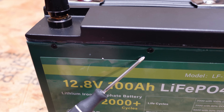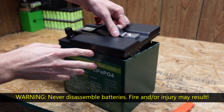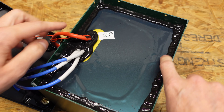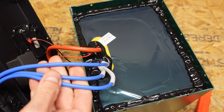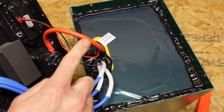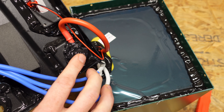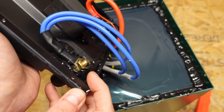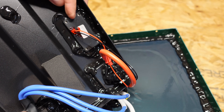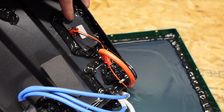There are a number of Phillips screws along the top of the enclosure — and that came off fairly easily. So there's the battery inside. The sticker says 100 amp hour but it's encased in epoxy board, so I'll have to cut all the sealant to get it out. The cabling is interesting: three number-10 silicone wires feed the negative and one number-seven silicone wire feeds the positive. There is also a very large glob of sealant on the positive, probably to prevent that bolt from coming out, but the negative terminal is not sealed in the same way, which is rather unusual. The state of charge sensor on the front is only fed by a positive and negative voltage sense cable, so there's no shunt actually metering amp hours in and out — the state of charge display will not be completely accurate.